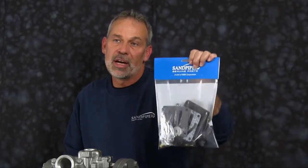That completes our wet side rebuild of our HDB 1.5 inch. Our rebuild included check balls, diaphragms, sealing rings, gaskets, O-rings. If doing a complete rebuild, also see our video on airside rebuild.